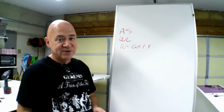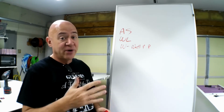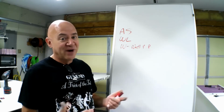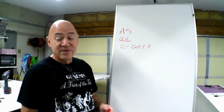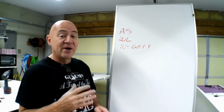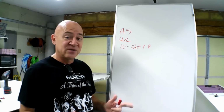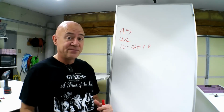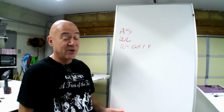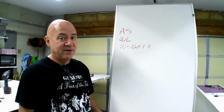150 to 200 watts a pound is great. If you're flying the stuff I fly, I'm in the 100 to 120 watt range. If you're flying my vintage airplanes, I was at 85 watts a pound. This cargo airplane, when it is fully loaded at 100 pounds, will be about 108 watts a pound because I got 10,200 watts out of the 4 motors. Okay? But with it empty at 75 pounds, it's going to be like 130 or 135 watts a pound. So the plane's going to perform awesome empty.